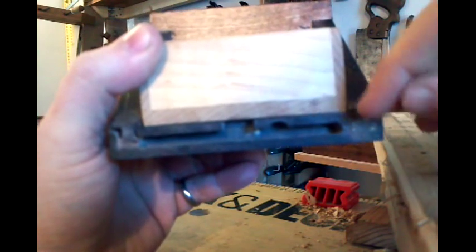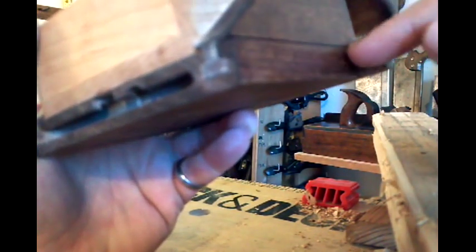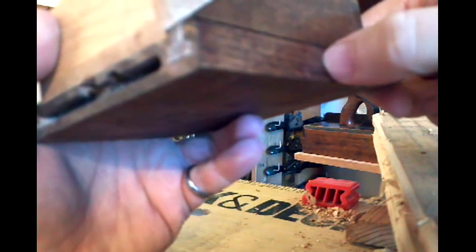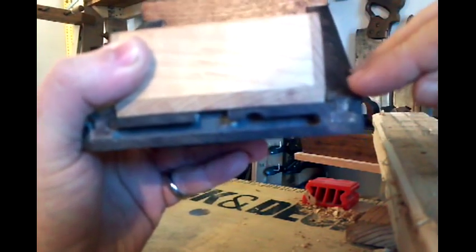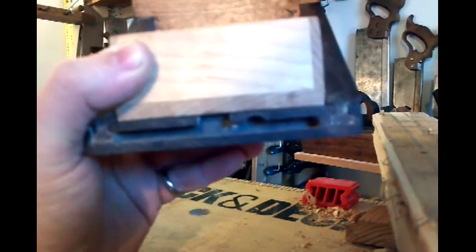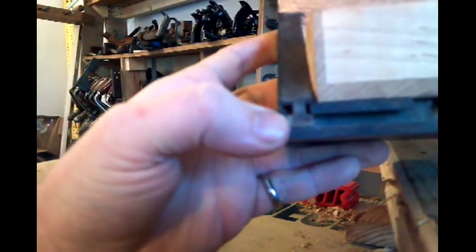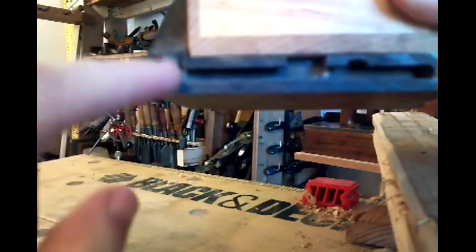I set the slotted key at a different level — a little deeper down into the piece — and mortised out this one on the router table. On the side pieces I ran it all the way to the back, but on the bottom piece I stopped it short of the end. For the sides I adjusted the fence on the router table, came in from the side, then flipped the wood around and removed some from the other side. Since the depth remained the same I was able to slide one onto the other. Doing both sides at once kept them even — outside has more wood removed than inside.